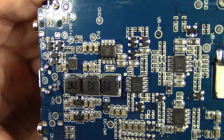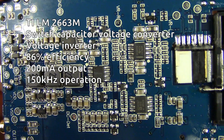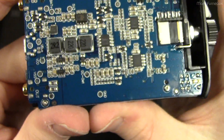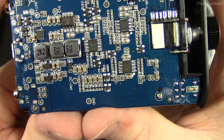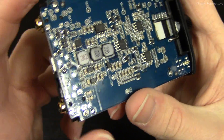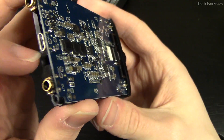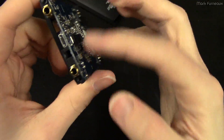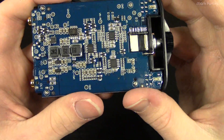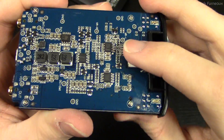We've got our power supply up here — I'll inset what it is later. This other chip doesn't appear to have any markings, just what looks like a pencil marking on it. My guess is this is one of those ubiquitous 8-pin unbranded Chinese microcontrollers. I think it's a micro because when you charge the thing, the LED does a PWM sequence, so there's got to be some logic behind that. This device also does pulse sequences if it sees a DC offset at the output, indicating internal protection — so there is some system control being done. There's not enough discrete stuff here for that, so there's got to be a micro.